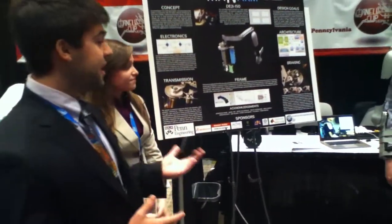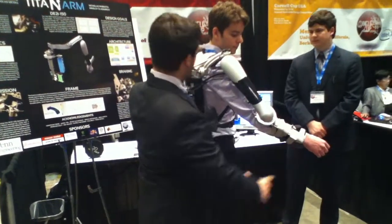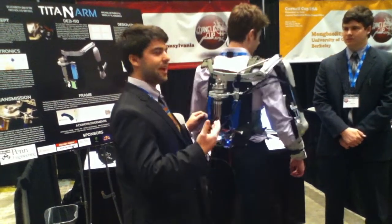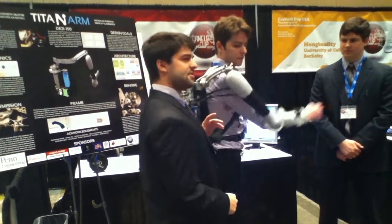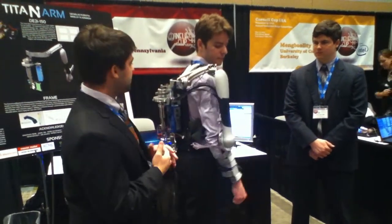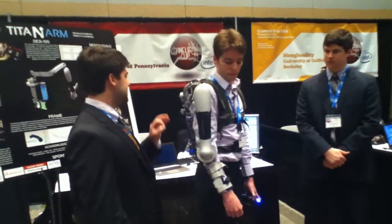As Elizabeth mentioned, there are two main mechanical subsystems. The first is the structural, which comes from the back plate, out through the shoulder, and along the user's arm. Highlights include the back plate, which provides rigidity to the user's back — this decreases the chance of bad lifting posture and hence injuries. From there we have a 3 degree of freedom shoulder joint that closely matches the natural range of motion of the user's shoulder, and then it extends along the user's arm to the actuated elbow joint. We did both classical and numerical analysis, including FEA, to test our components.